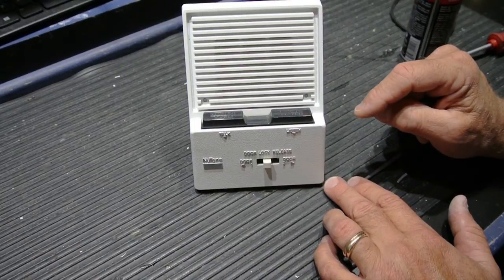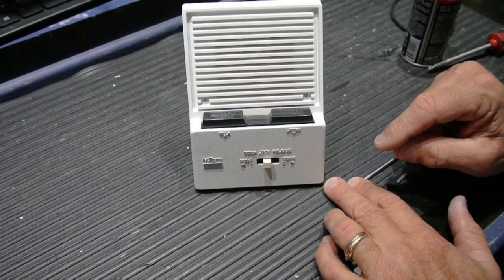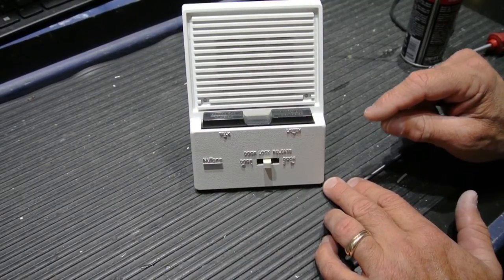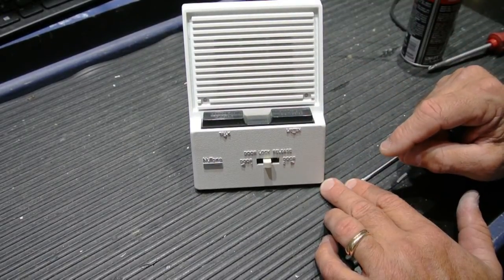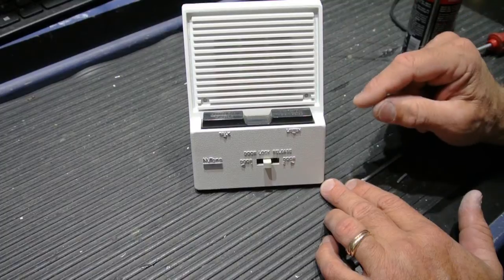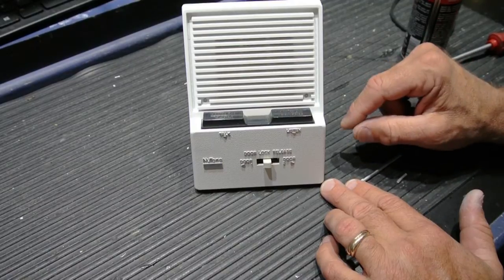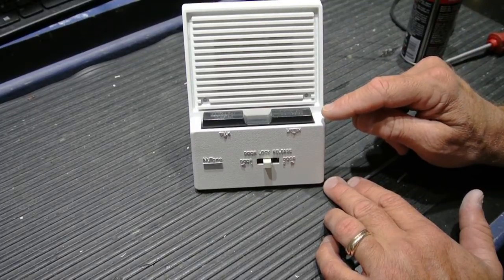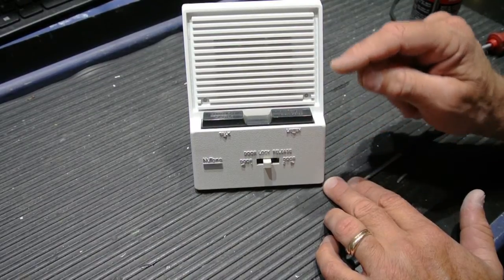And it's a matter of someone going through and cleaning all of the switches in all of the apartments. Usually this only has to be done once every maybe 15 years or so. If you do a thorough job, it's not much of a problem at all. I've installed a lot of 478 apartment house systems when they were new, and it's not uncommon to go 10 years or more before you get the very first service call because some switches might need to be cleaned or there's some small problem. These are very long-lasting speakers, and the switches are a higher quality and better switch than what was used in residential systems because they know that they have to last a long time, and they do.